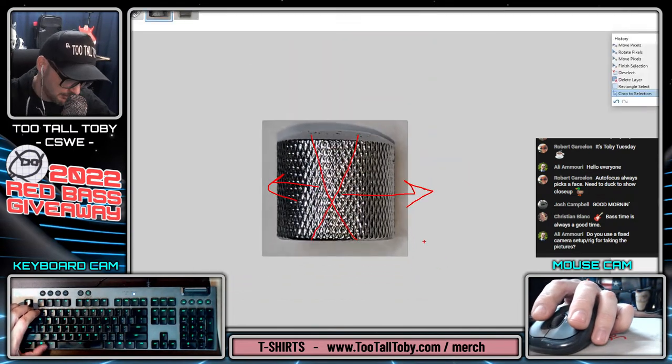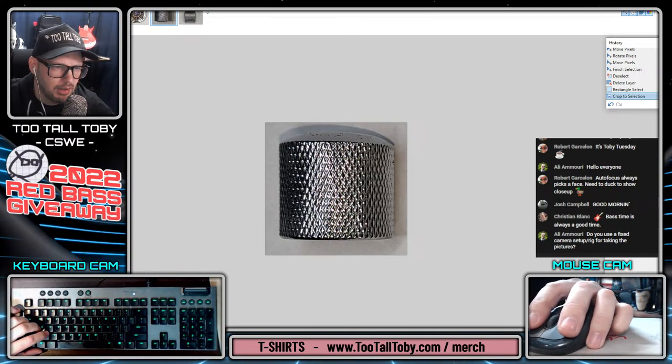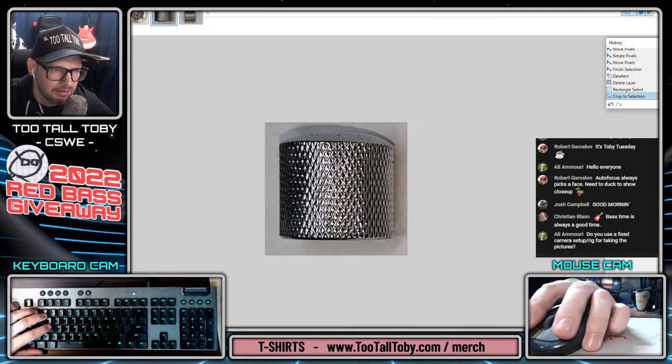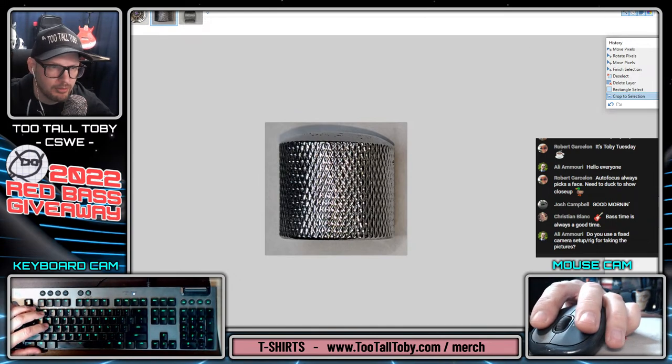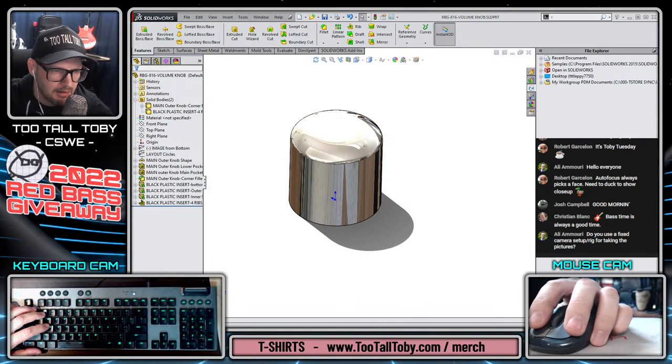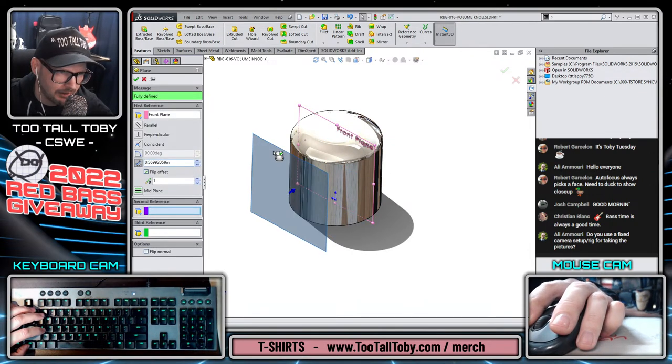And you've got your helical groove coming up through this way, and then that is patterned the same way. So the challenge here is figuring out how this thing is actually spaced, and what the pitch and the height of that helix is. An easy way to do that is to work with an image, to utilize an image in your design so that you can easily see if you're on the right track for that helix constraint.